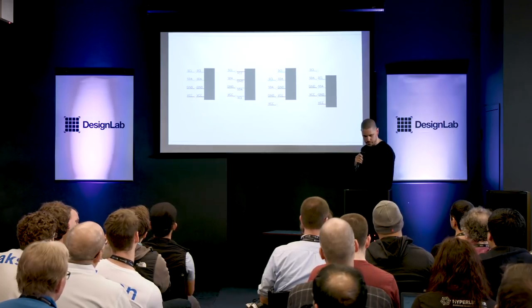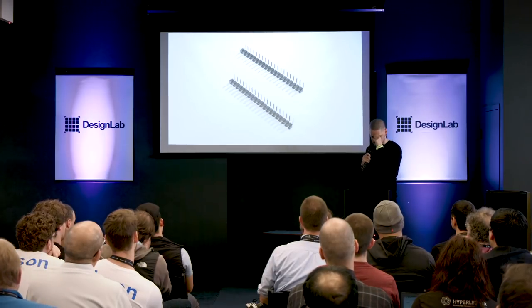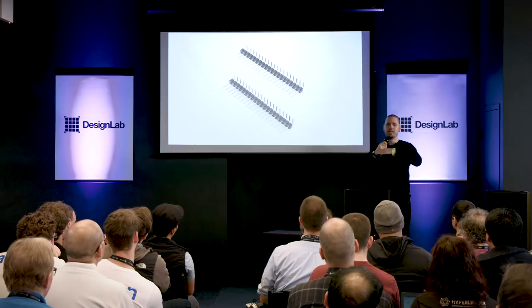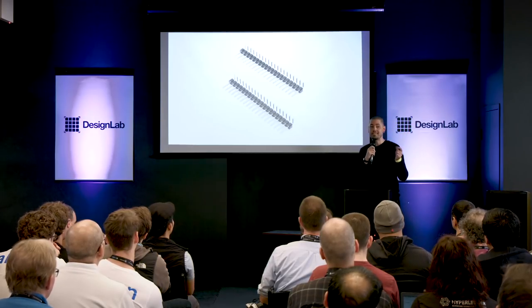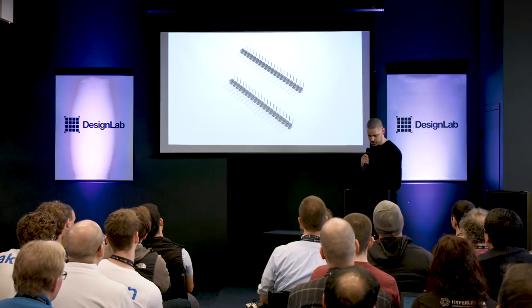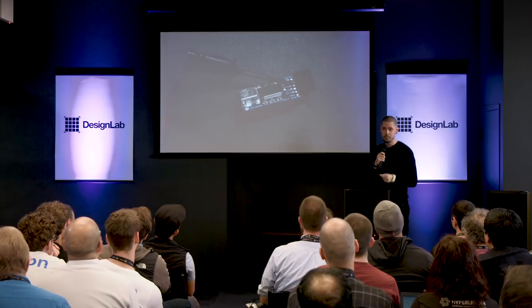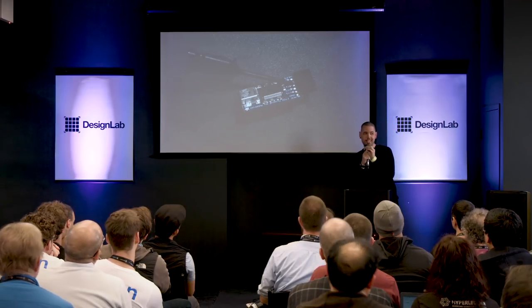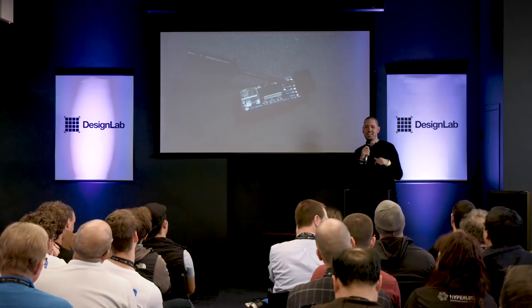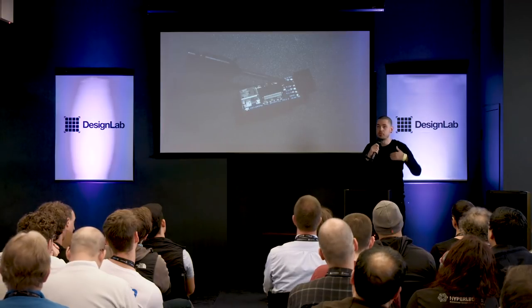Whether or not you lay out your own board, if you use square pin headers, I think it's a good idea to use right angle headers and keep them out on the edges. That keeps the wires at the perimeter of the board and not in the way of your test points or LEDs. The other nice thing is that if you use right angle headers, you can still get probes on all those signals when everything is connected — you don't have to slightly pull a connector out and try to sneak a probe in. Use right angle headers and you can stick the little grabby probes on those things even when everything is connected.